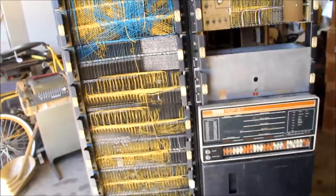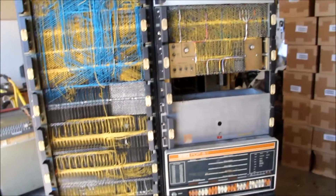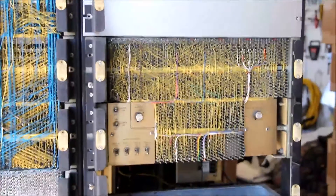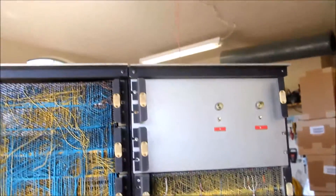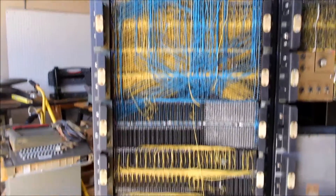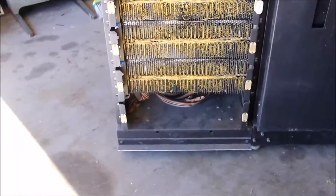Let me move around to the actual front of it here. There's the PDP-8. There's another power supply, a regulator. There's the DF-32 itself. One drive, another power supply board up there. And then on the front just backplane, backplane, backplane, backplane — almost the entire rack except for the bottom. There's one missing there and this one's dented in as well.